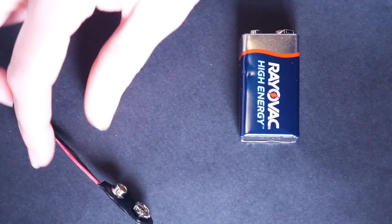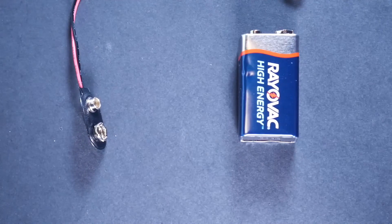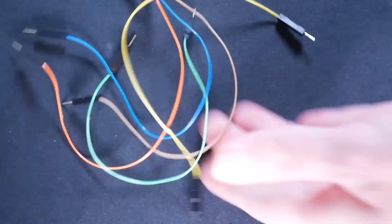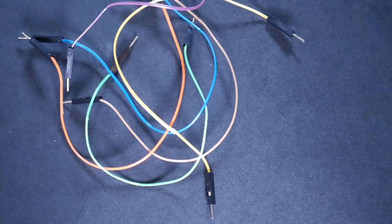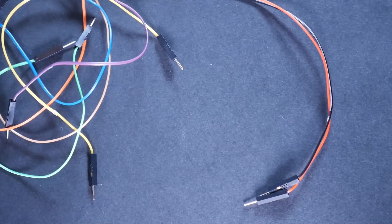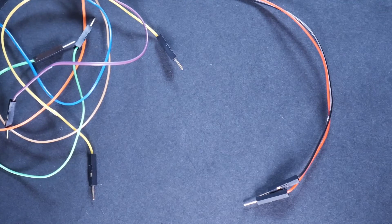We're going to look at a part you're probably more familiar with, which is a 9-volt battery. The 9-volt battery will attach to this snap connector — the ends just go right on there. If your kit came with a set that has a case and AA batteries, that's okay, that works just fine. To connect all of this together, we're going to have six jumper wires. Yours might have come on a strip; if they did, just grab one of the wires at the end and pull it right off. You will need six in any color, plus two more — and I would like those two to be red and black. Traditionally in electronics building, we use red to indicate positive and black to indicate negative.